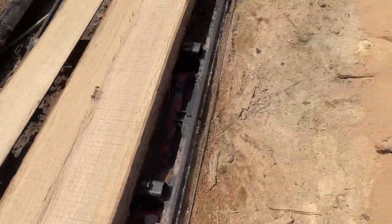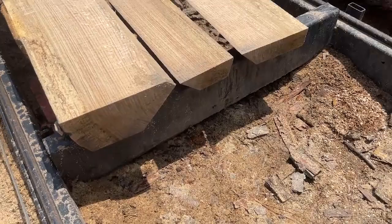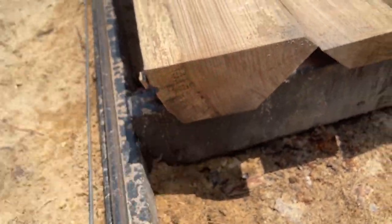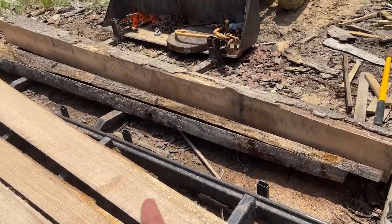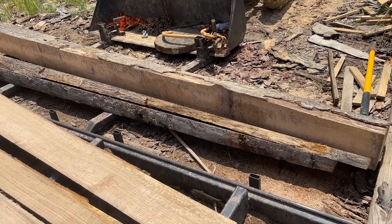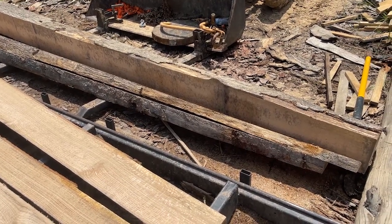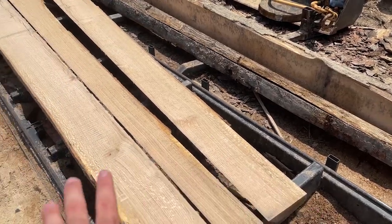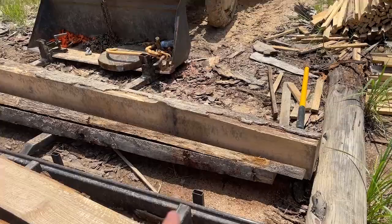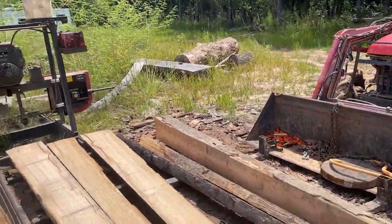It's at basically 16 quarter, so we'll split it in half to make 8 quarter boards. And then these two edge pieces, I can throw them back on and cut each one of those again to get a really short 8 quarter piece. And that'll be it for that quarter of the log. And so then I've got this other bigger quarter and I've got the other smaller half still over there from the other cap.